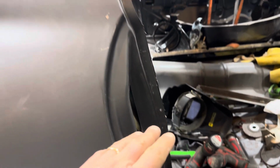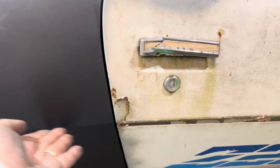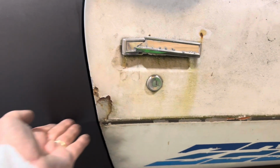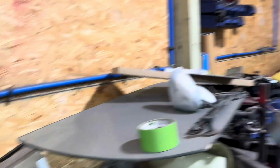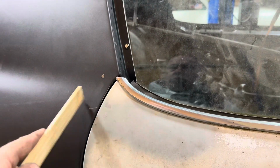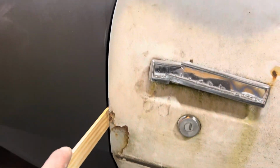All right, guys, so I had some screws in there. I just took them out, quarter panel's on there. I'll show you what the gap looks like. Fender line, body line lines up because this matched that with the old one. But the gap is a little too small. Had my stick. If you look here, I'm not worried about the door really because the door is adjustable. So the paint stick goes in there, and it gets real tight right here.